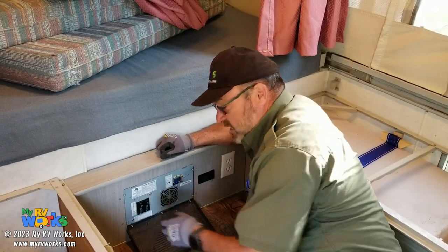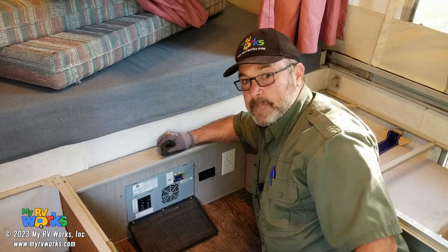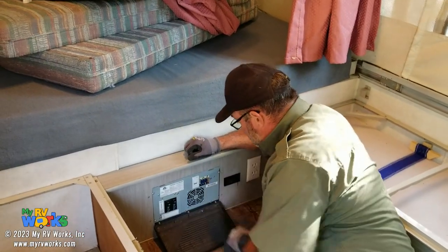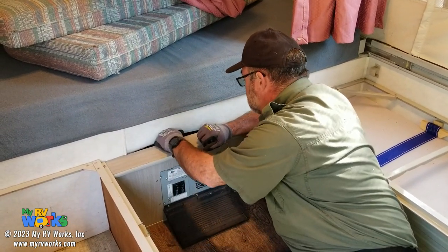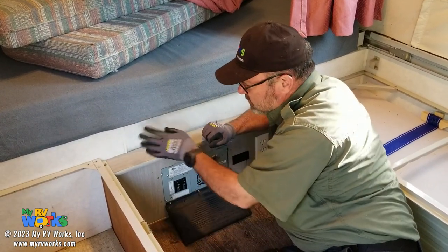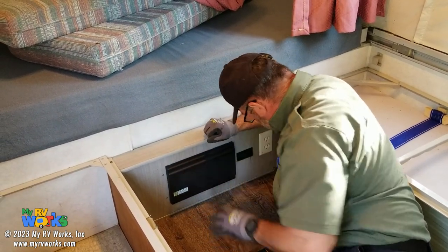And on the breakers themselves, if you look at the side of the breaker, it'll tell you what the torque value is supposed to be based on the gauge of wire you're using. So then we've got some fuses here, and this wall looks a little weak. Back in there, there's a whole big void. So there's some fun stuff we can play with back in this area if we needed to add more stuff.